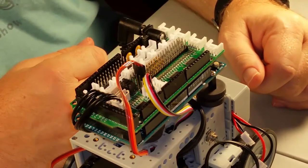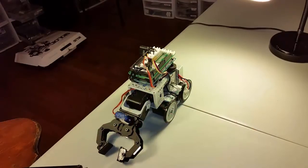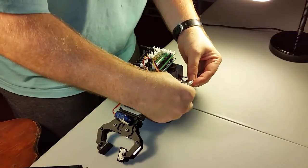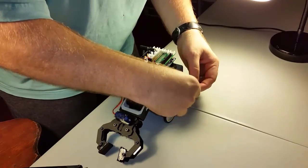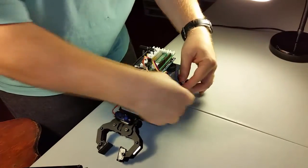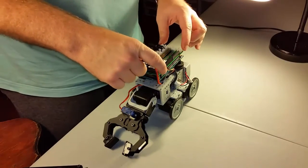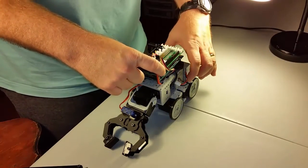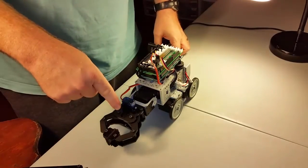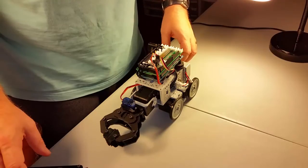And that's it. With these five connectors, we're now ready to control the Gripper robot and drive it around. First, let's make sure that our battery is plugged in and that the battery has been charged correctly. Once you've uploaded the sketch to your Arduino and made sure you have the right one in, you should just be able to turn it on. Immediately you'll see that the wrist servo and the gripper servo will go back to the default position, and we should be ready to drive.